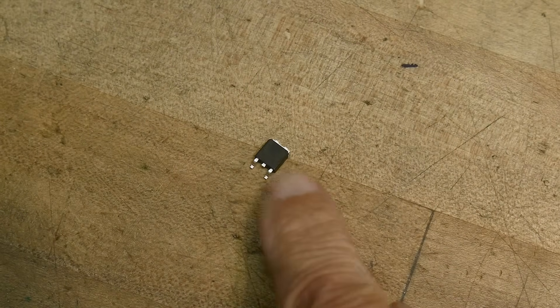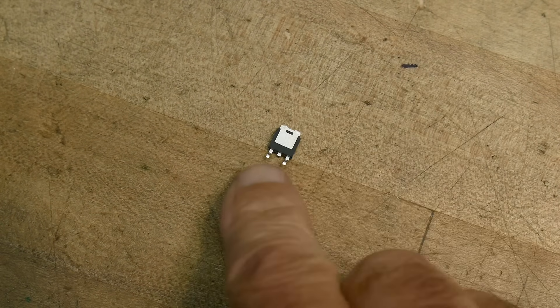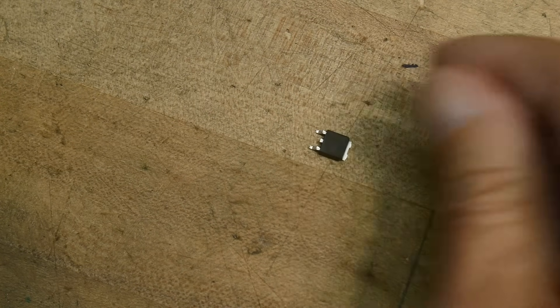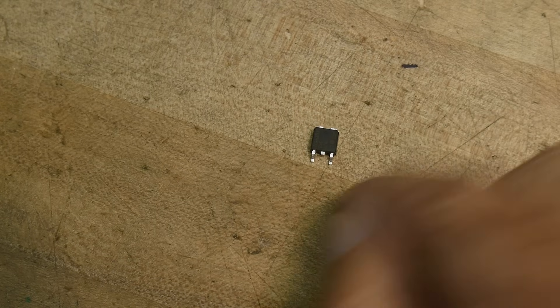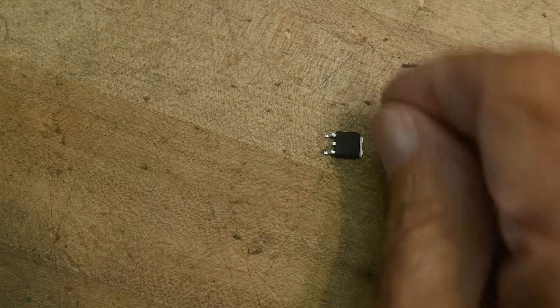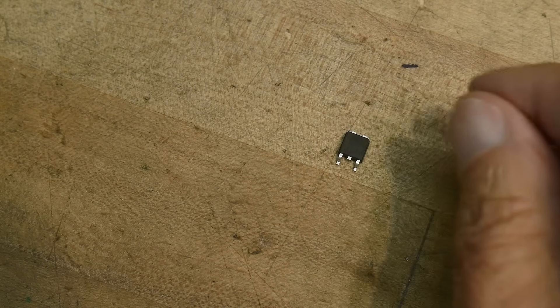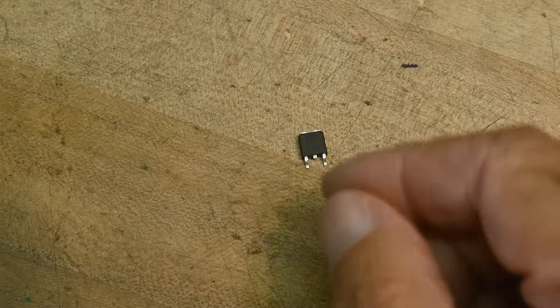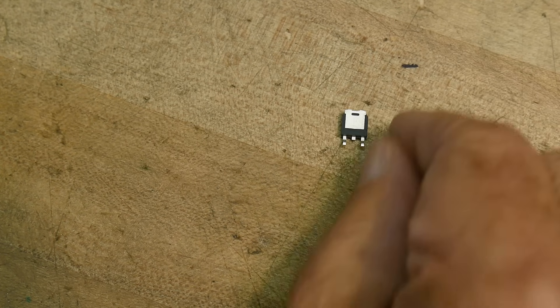Chip of the day. We got one of these. I like these packages — they have a nice big tab on them. The spacing is such that you can kind of attach them to a normal PC board if you wanted to, without even doing any surface mount work. I'm not sure how much power-to-space you can get out of just the tab, but we will look at putting it on a little bit of copper, which you would do on a board, because you need to be able to solder that big tab down.